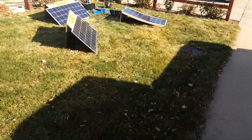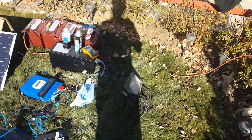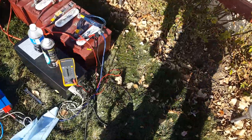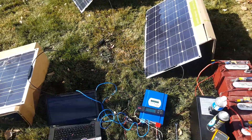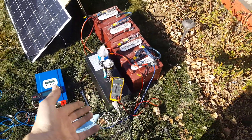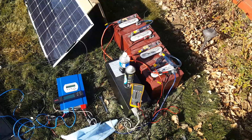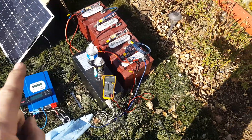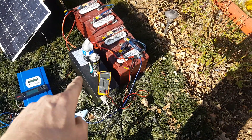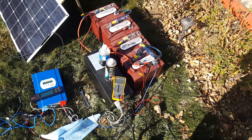When I want AC, I can use the inverter. What I like about using a UPS is that it has a plug, so I can plug this in. If there's no solar and I'm storing it in a garage, I can plug it in. It's kind of like an automatic transfer switch — it switches to external AC power, so everything inside is powered off the external AC and it charges the batteries. Since I modified the FETs in this, it does about seven amps charging current now, so this thing has no problem charging these giant batteries.